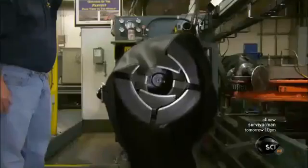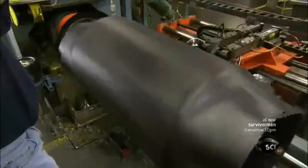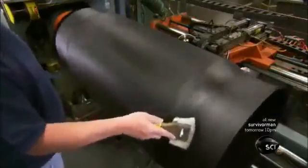A skilled tire builder then joins the edges of the piece to form a band, sticks it to an identical band made of an opposite bias piece. Layering increases strength, then stretches this two-ply band over a tire building machine.